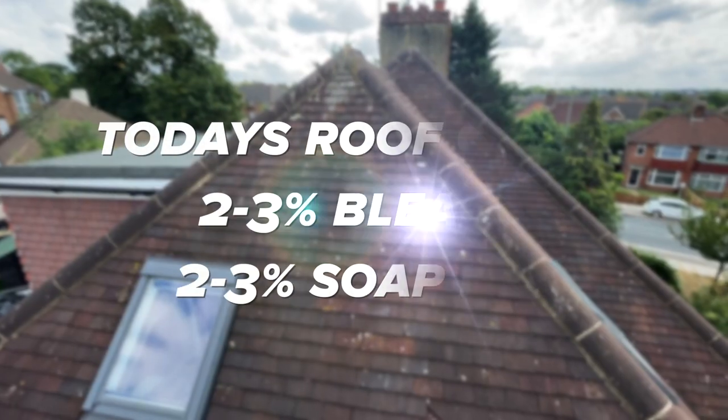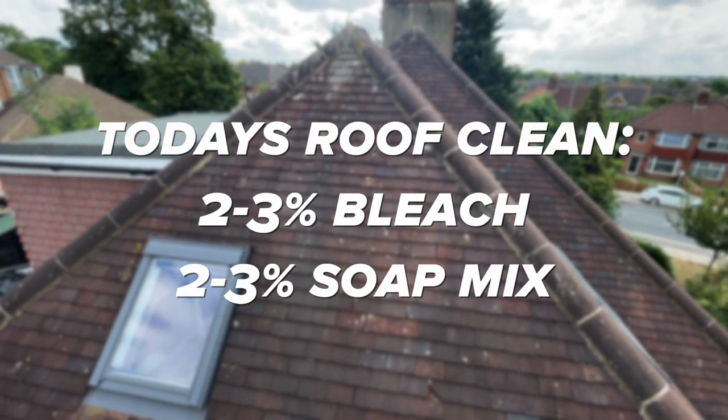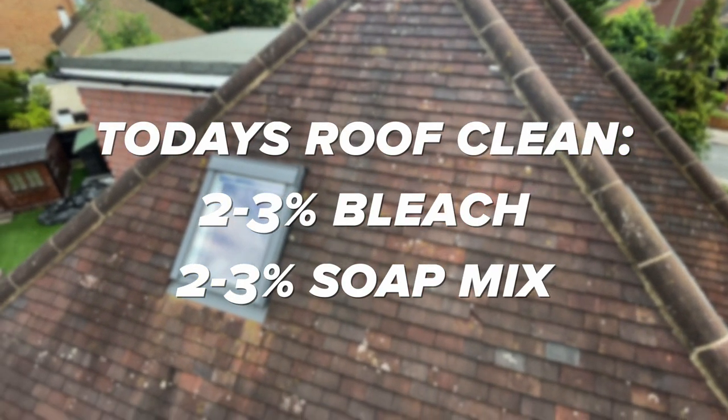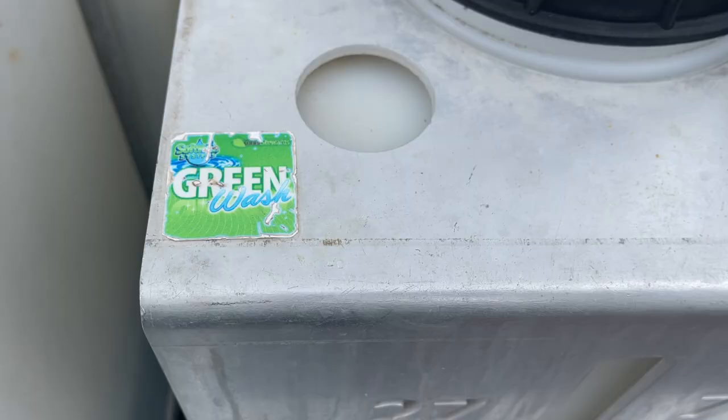So today we'll be running about a 2 or 3% bleach mix, which should be plenty, and about a 2 or 3% soap mix. And we're using a green wash, which is basically like a surfactant. And it's also got some additives in there that work well to help the bleach make the best results. So stay tuned, check out the results and see what you think of soft washing. Leave your comments below.